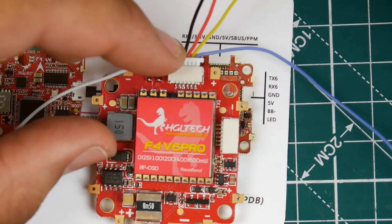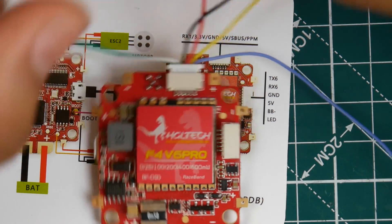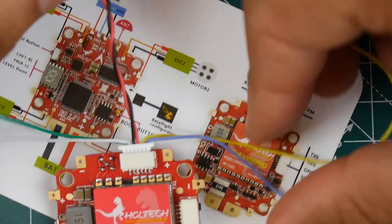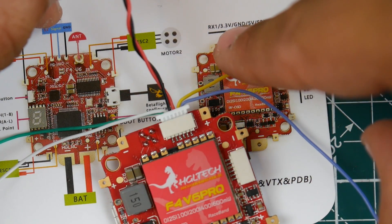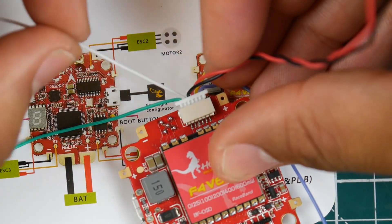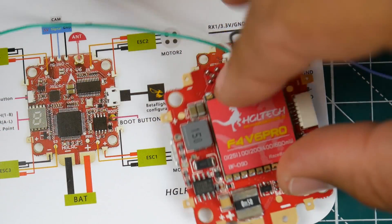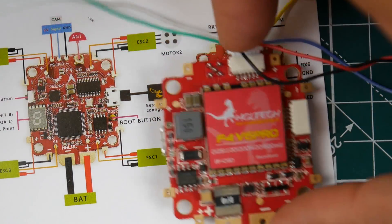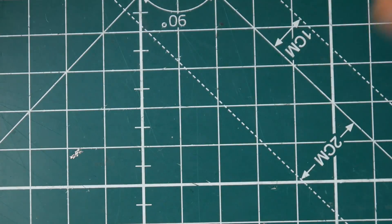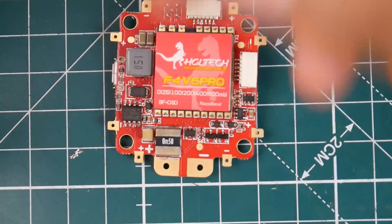If you want to power an iBus receiver, install the signal to RX3 and take the 5 volt and ground wires from the connector to power your receiver. For Spektrum, the 3.3 volt wire is right before the end — that's 3.3 volt for Spektrum with the ground wire, and you'd ignore every other wire. You could also put iBus on the green wire, which would be RX1 — so UART1 would be the serial RX port for iBus. It's not the most well-thought-out setup; they could have just added another 5 volt pad.